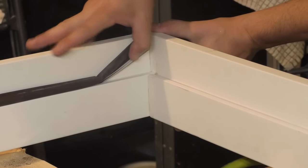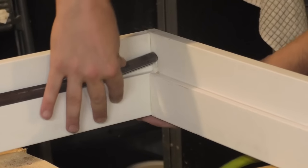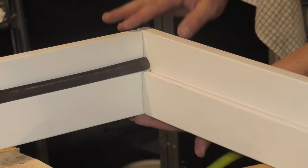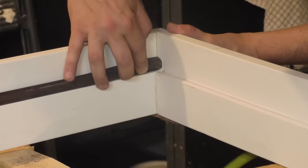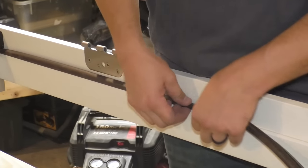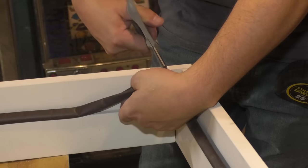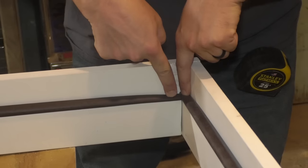Really what's important is to get this perfect right here where these two meet, because that's where the door is going to close. Ideally, if the door was made in a satisfactory way, this bottom will line up and this will too, but that is not the case with this door unfortunately. So I'm going by that right there. I'm going to put this weather strip back in place — now's a good time to make sure it's good at the bottom. I'm going to cut it right here. When the door closes, nice and airtight.